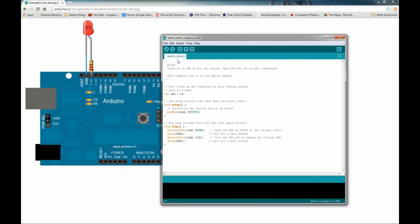Now that the code is ready, up at the top you have buttons: New, Open, Save, and Verify — Verify is your compile button. I click Verify and it compiles the code down at the bottom. If there are errors, it will show them. When everything works it says 'Done compiling,' shows the binary sketch size, and confirms no errors. We are good to go.